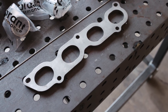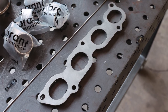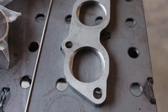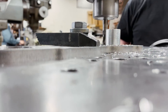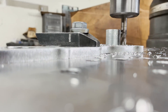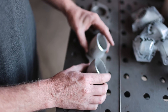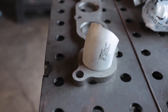This flange comes from Vibrant Performance — it is three-eighths of an inch thick and is made of T304 stainless steel. It's ready to go out of the box, but I wanted to add registers to it, mostly to make it easier for me to build this thing and to give me a bit more to work with in terms of welding. So I took the part next door to Nimmo Machine, and with the help of Jess, clamped it down to the rotary table and got to machining. You can see how the Schedule 10 pipe registers in this, and then we'll move on to building the collector for the turbo.